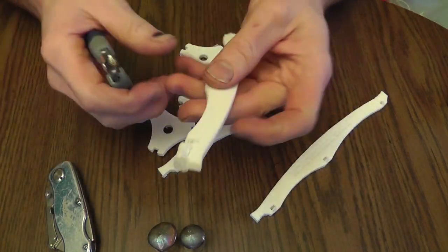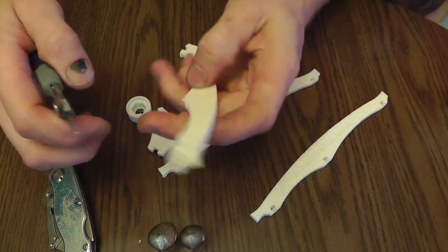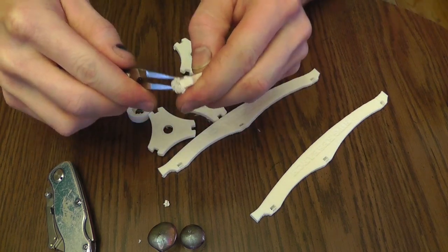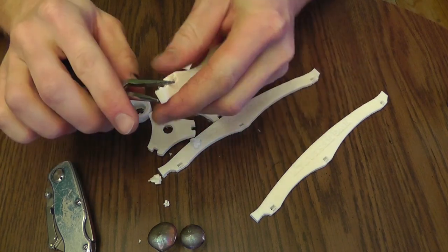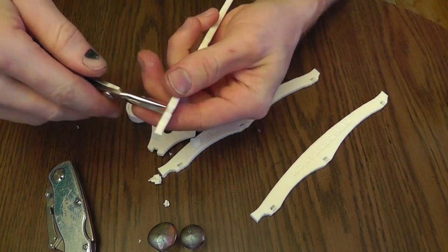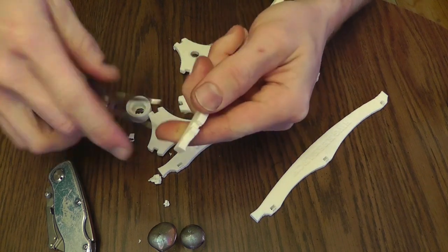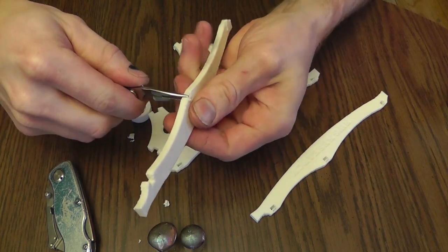So the first thing you're going to do is the uprights. I actually have a tiny bit of space on the bottom to support the entire top, and it's only about, I think, 12 millimeters tall. So that pops off fairly easy, and then just clean that bottom part up. That helps support it when I print it vertically. Then, since I'm printing it vertically, I've got these little spacers in the drawing that actually sit between the top and the bottom in between the slots.